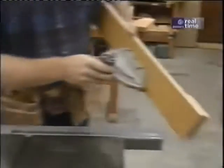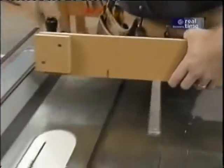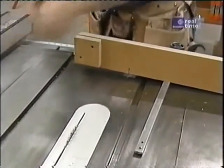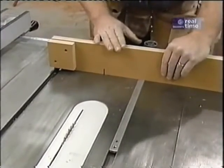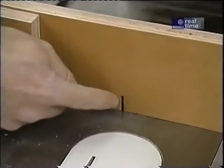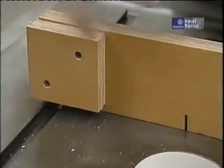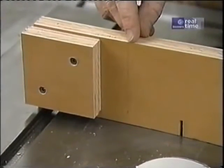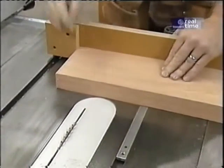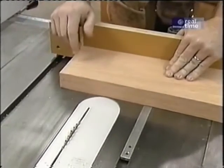So what I've done is modified a miter gauge — I've screwed a long straight piece of wood to another miter gauge I have in the shop. We're not even going to use the rip fence with this system. After I put the piece of wood on the miter gauge I made one pass through the saw, which gives me a precise location of where it's going to cut. From that mark I can measure over whatever tenon length I want. I've fastened the stop block for my longer tenons, and later I'll move it for some short tenons. I just hold my stock against the stop block — the first cut is along the face, three-eighths of an inch deep, and I'll do both sides of both ends of all the pieces.